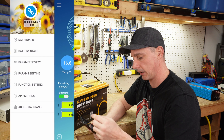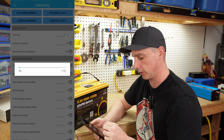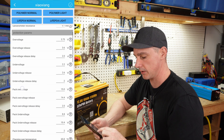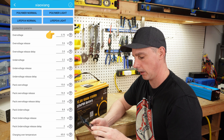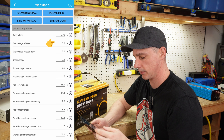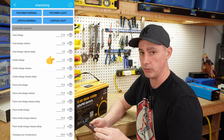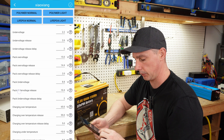With this app, I have an aftermarket version so I'm able to see and change parameters. Let's take a look at their parameter settings. We can see over voltage is 3.75, over voltage release is 3.6, and then we have under voltage of 2.2 volts — I think that should be about 2.5, which is going to bring the release up a little bit.